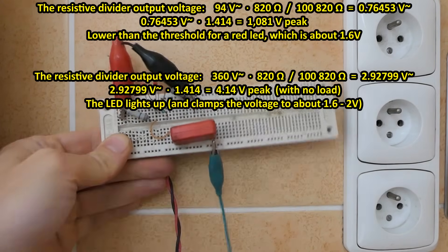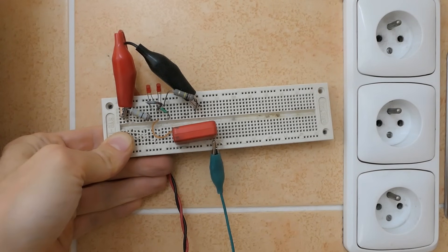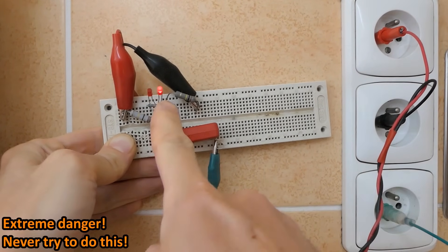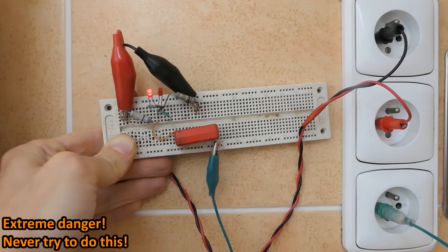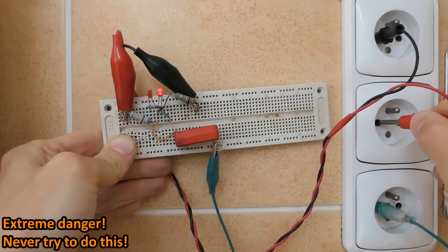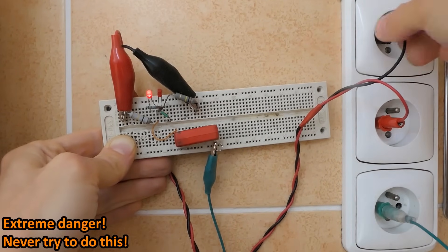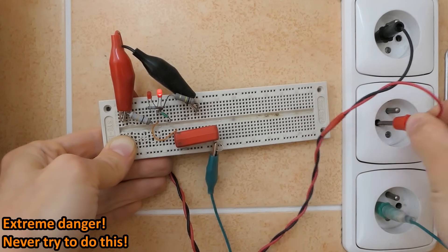Now testing time. For some reason this apartment has three sockets in the bathroom each on a different phase — yes, absolutely brilliant to put three-phase 400 volts into a breadboard, but let's test it anyway. One LED lights up — the one on the right. When I swap two phases, the one on the left lights up. If this phase is missing, both light up; if that one is missing, the other one lights up; and with the third missing, no change. The disadvantage of this circuit is it does not give a clear indication of a missing phase — one case shows no change, another gives a false reading indicating the wrong direction.